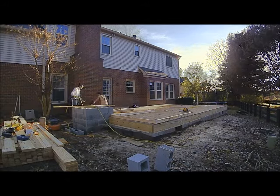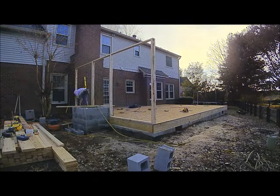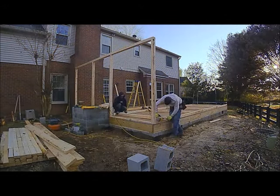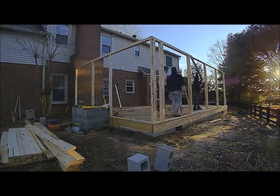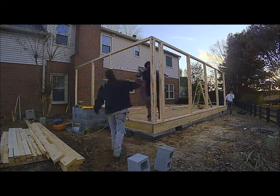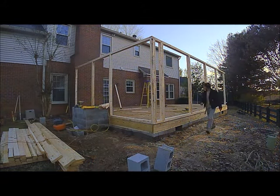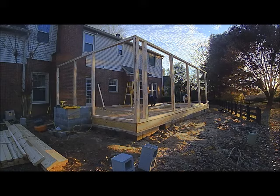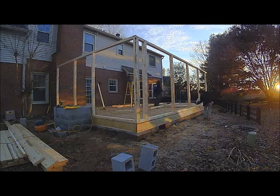Floor is pretty much done and we're getting the walls put up. We're going for five-foot-wide windows through the sunroom. In between each window there are approximately six two-by-fours. Importantly, your top wall plate needs to be doubled, and they interlock with the adjacent wall. The front wall's very top two-by-four overhangs the side wall and nails down to it — this is what locks all your walls together, and it's code required.